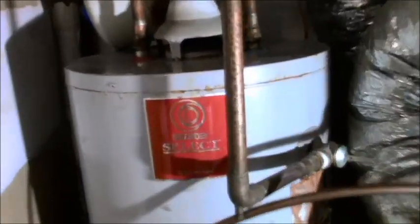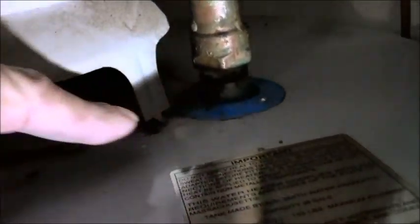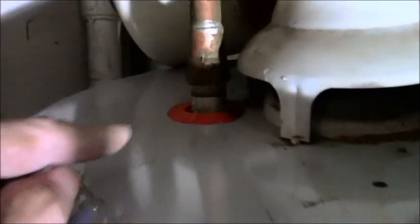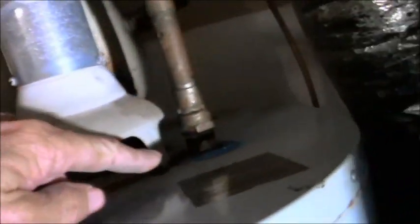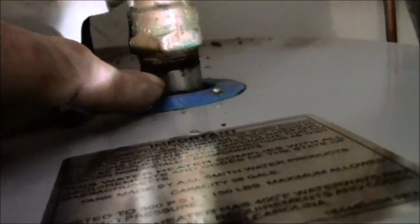When they go bad, what happens is, I have a little water still residual there, water starts gurgling up through this hole. Actually, there's two holes there, pre-drilled holes. And or your connections that go inside your water heater with those little nipples go bad. And because this is hard plumbed in with 3/4 copper, by the time you cut the copper and pull that out and find out that you're rusted on your nipple, which looks to be the case here, you're also rusted on the inside female end too.